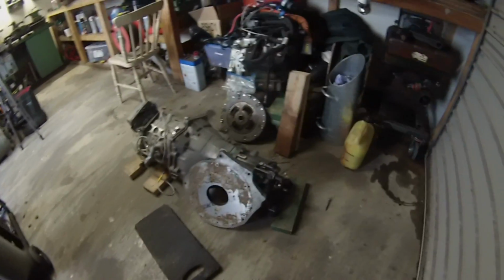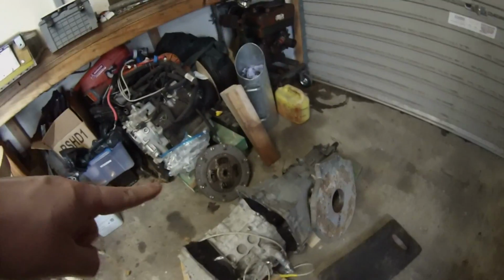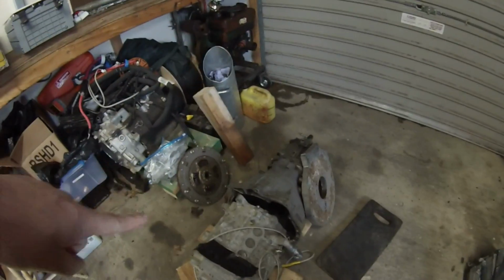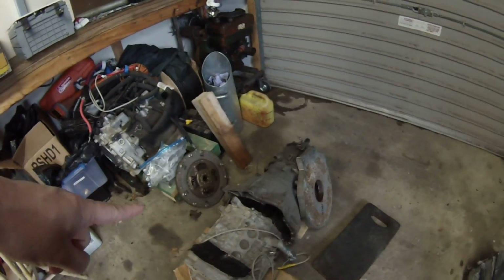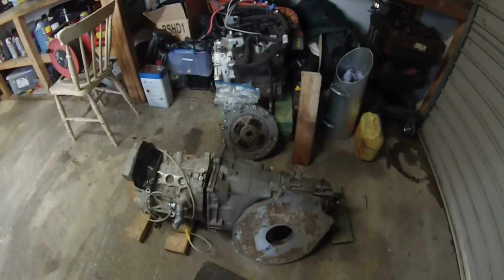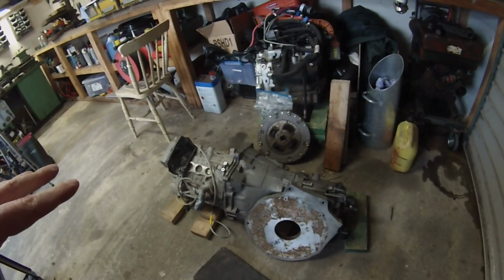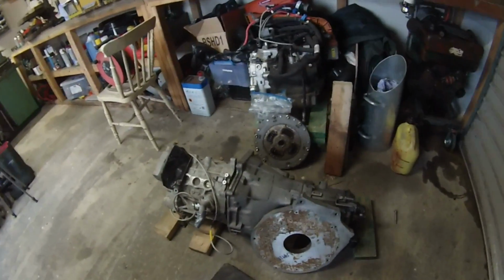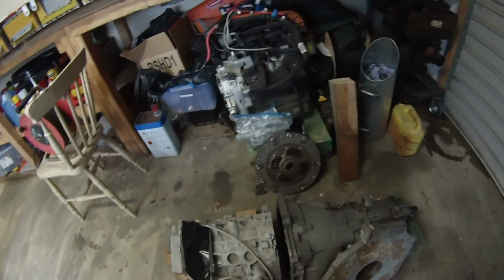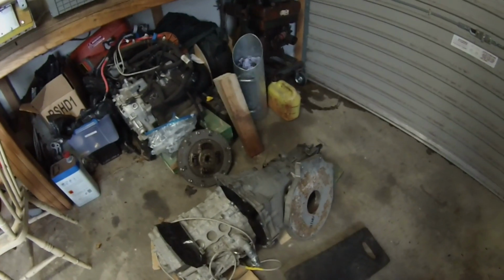Now, that means that this plate will bolt up to this gearbox. And we can then locate the motor onto this side of the plate here and basically drill and tap the holes to mount it. So that's one part of the procedure. The second part is that we need to get drive from the motor shaft to the gearbox input shaft.